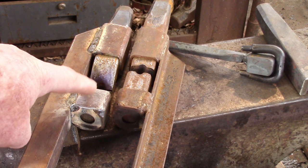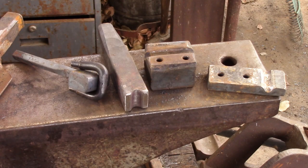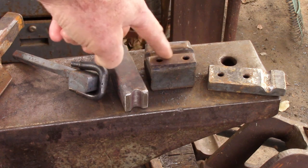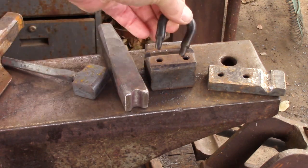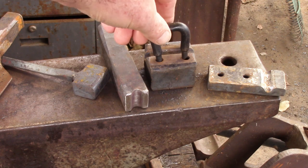To create the tenon, I've got a butcher and I've got a swage. To create the staple, I've got a handheld top swage along with a bottom block and swage. Those two holes are to receive the tenons as I put the shape on — that flat spot on the top.